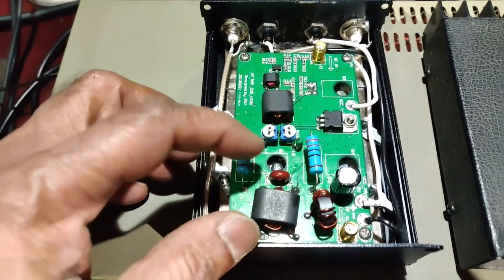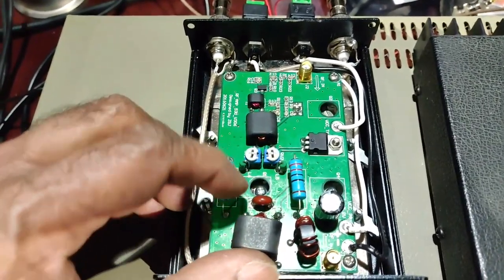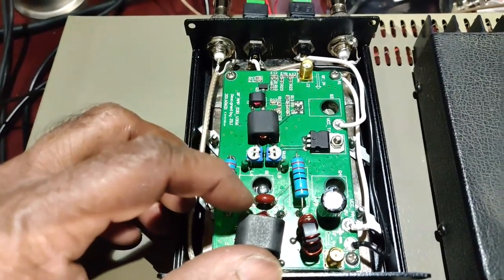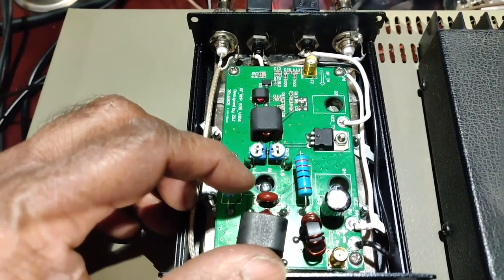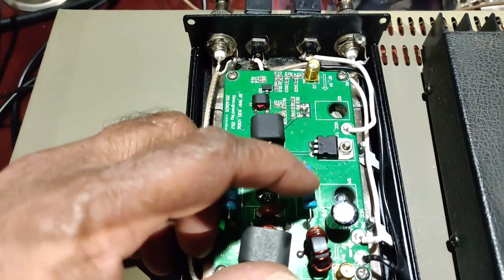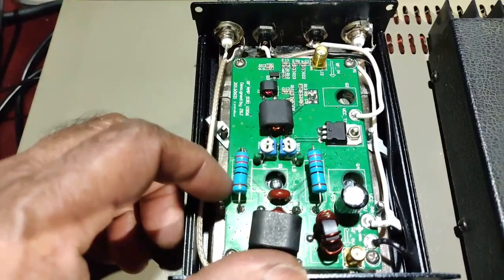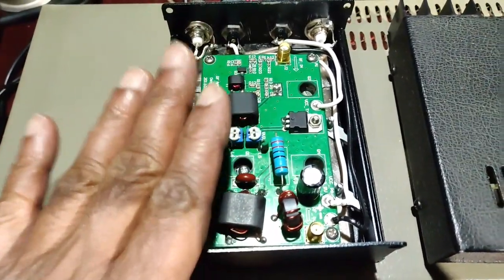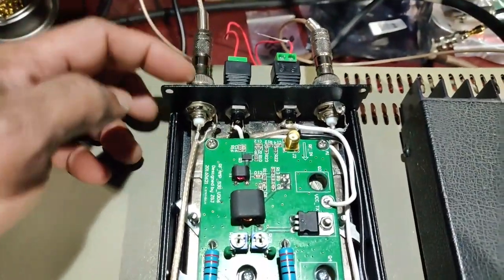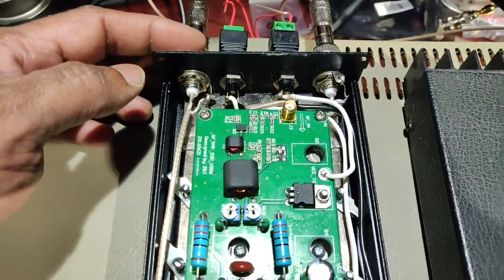In the original circuit there are two temperature regulation diodes for the MOSFETs, which are mounted on the PCB — nowhere close to the MOSFETs themselves. What I have done is removed those SMD diodes and placed 1N4148 diodes directly on the body of the MOSFETs, then wired them back to the PCB. That way there is at least some temperature regulation. Purposely I have not put any low-pass filters in this, because the output goes back inside the Atlas 210X to its own low-pass filter.